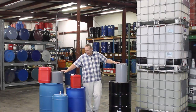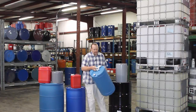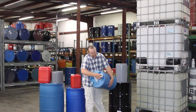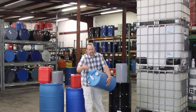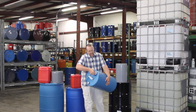Now the next step is when you go into the drum quantities. This is a 100-pound drum and it's got a two-inch bung on one side and a three-quarter-inch bung on the other. You are going to use some sort of bung wrench to take this off. You can use pliers by inserting them into the grooves on both sides — you come in with the claw and then spin it off, or you're going to need to purchase a bung wrench. People who are manufacturing and have warehouses and use forklifts have bung wrenches, but for you smaller guys as you start getting bigger and ordering 100-pounders, you can use a typical wrench sideways with the teeth.